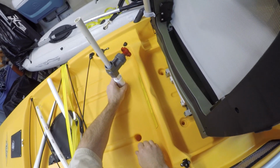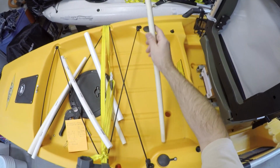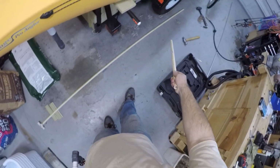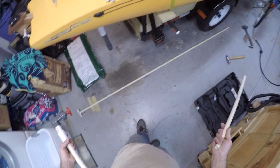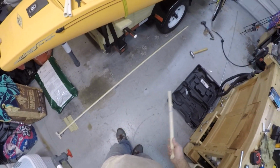So, let me say again what I've got going on here to recap. You don't have to build this stakeout pole, but I did for about $25. $25, 9 foot 1 inch. I have a Metals for You, and I was able to buy 20 foot of Schedule 40 half-inch aluminum tube for 20 bucks. That's the key.